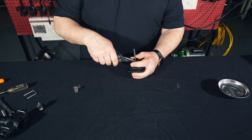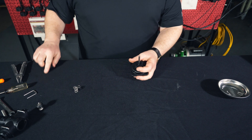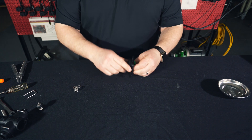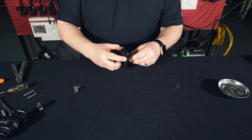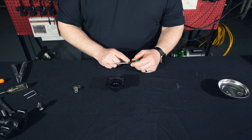Next, we'll take our pliers and remove this crescent clip from the stem — we'll discard that as well, as our kit will have a new one. We'll separate our stem from our liquid housing, and this gives us the first set of O-rings that we need to replace.